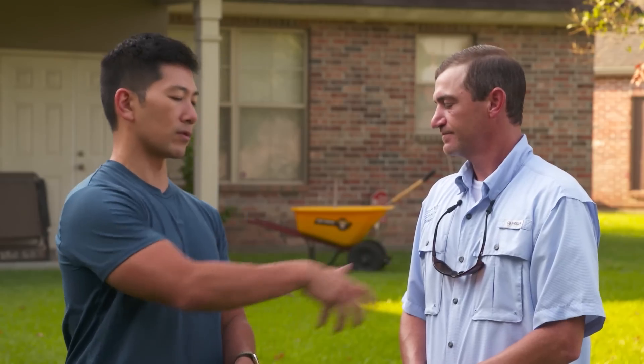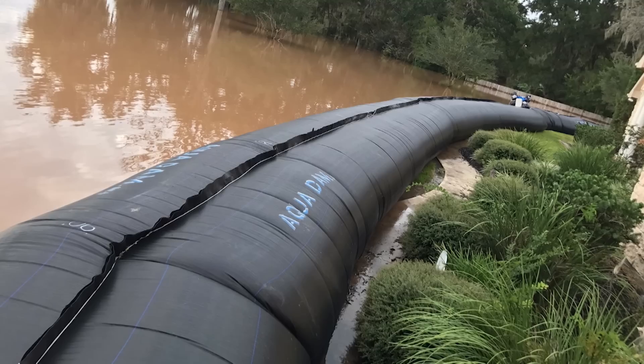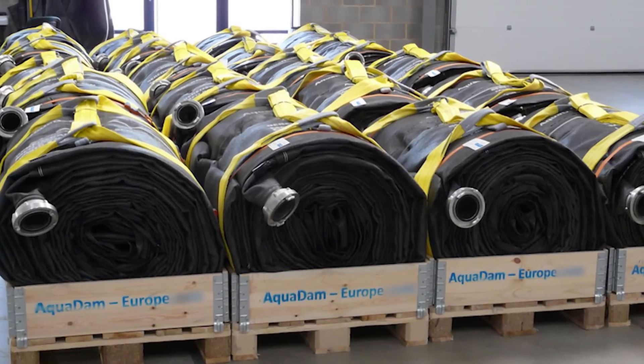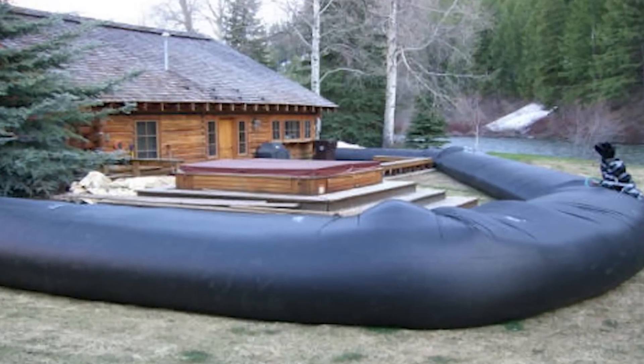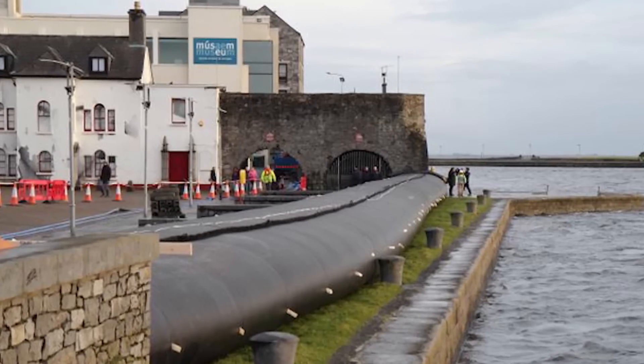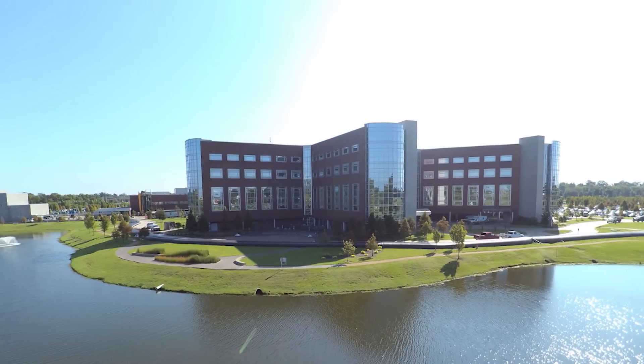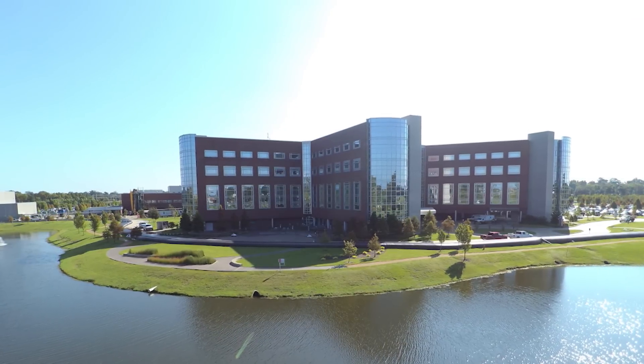Let's say you want to inflate this 500-foot ring around your house. How long does it take to inflate this? A small dam, three foot or below, you can easily maneuver by hand. A 100-foot section weighs less than 100 pounds. To deploy and complete the dam, an hour to two hours from the time you start filling until you're completely done and made the complete circle.